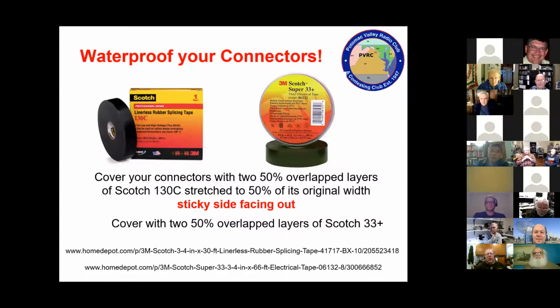And the way you install this, it's amazing when I watch people install electrical tape. You might think that the electrical tape they're installing is made out of gold, and they try to install it with almost no overlap. And electrical tape doesn't work when you install it with almost no overlap. The overlap should be at least 50%. The Scotch 133, you stretch it about 50% of its original width, and the sticky side faces out. Don't believe me? Take a look at the instructions that come with the tape.